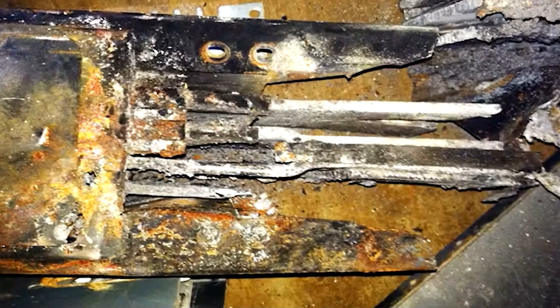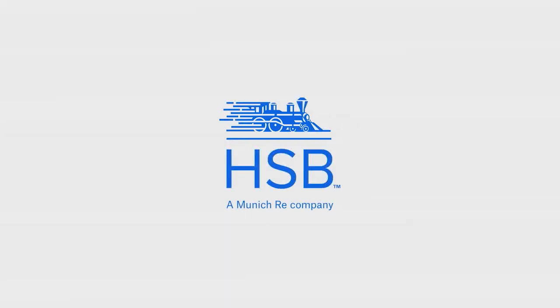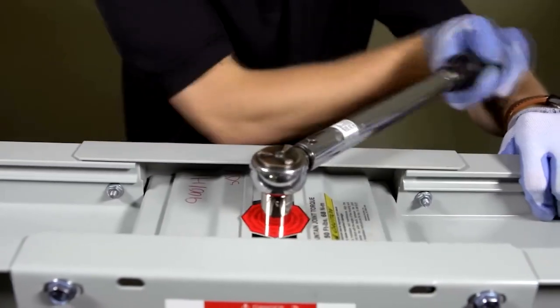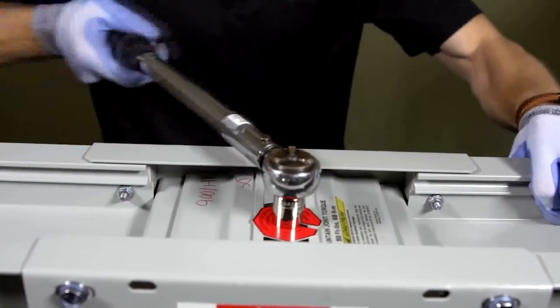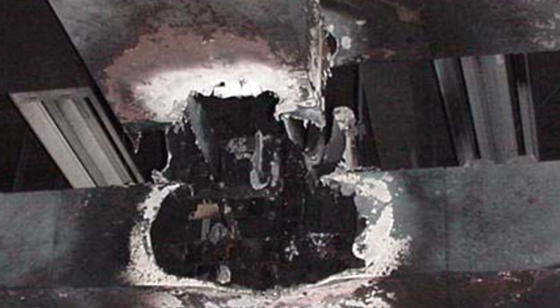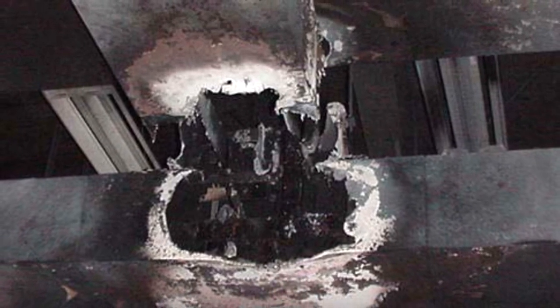Who better to answer an insurance question than an insurance expert? Let's talk with John Weber, Principal Engineer with Hartford Steam Boiler Insurance Company. HSB is an equipment breakdown insurance company, and busway failures and claims are a recurring theme for us — we cover both the electrical equipment and business interruption losses. Many failed busway installations result from improper initial installation and human error. Because busway requires many bolted electrical joints, it's easy for the installer to miss torquing a few joint bolts. When joint bolts are loose, there is still enough pressure to conduct electricity, but the bus bars eventually go into thermal runaway, usually resulting in an arcing fault and catastrophic failure.